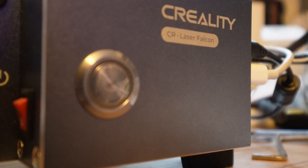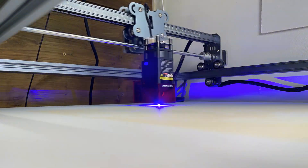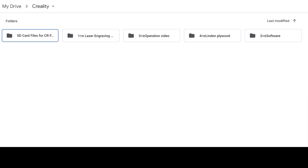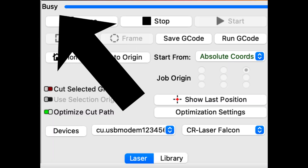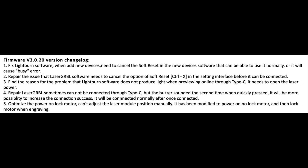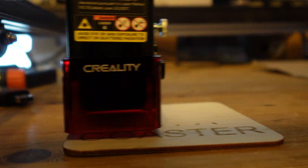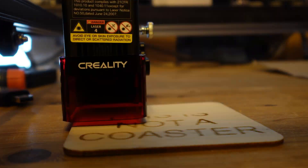The silver button does have various modes that you can set into, but I won't be going through that on this video. Unfortunately the SD card that was supplied was actually blank, so I contacted Creality to ask for the software — I'll also update this onto my share drive should you wish to download it yourself if you cannot find it on the Creality website. This held some code files and various software elements. One of the big issues I had was actually integrating with the software Lightburn, as I had missed that there was an issue with the previous firmware where the CR Laser shows as busy. Luckily Carl Fenton on the CR Laser Falcon Owners Group — which was at the time 25 members strong — managed to assist me with this and we flashed the firmware, so thank you very much Carl. Following on from that small problem, most things on the laser side had been pretty straightforward and depending on the software that you choose it'll be a learning experience on how to control the percentages used by the laser. I tested this on both my MacBook and a Windows PC and the software seemed pretty adaptable and user-friendly.